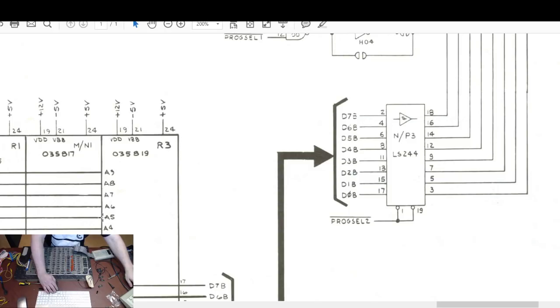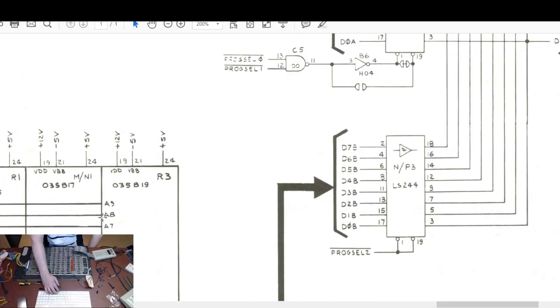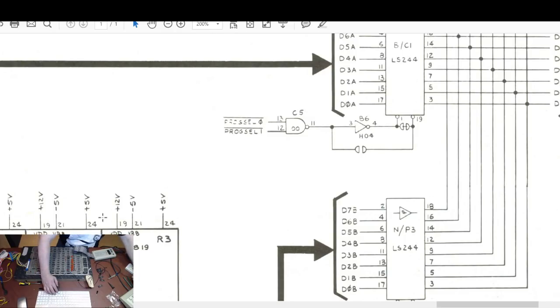So if I do a ROM verify, 7800 to 7FFF. So what I'm saying is that without BC1 in the board, right, we know that was going to happen. What do I get? I get the correct signature this time. And if I put the next chip back in sequence, which is 03A824, back into there, because that one will be visible suddenly as well.